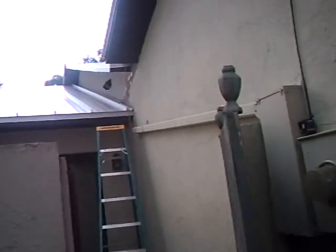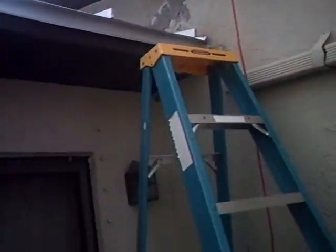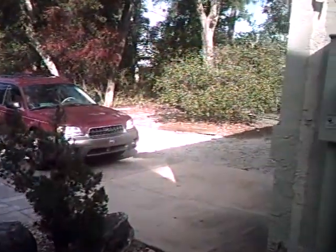So this is where the box will go. Make a capture box and then figure out some routing for the downspout. Still under construction. I'm going to paint that now to seal it up, and I like that elastomeric paint. I painted this stucco many years ago when I first got the house and just rolled it on thick. I used the primer and rolled 2 coats of primer, then 2 coats of sealer. I think they recommend you get about a 10 mil thickness on the entire coat, and I did get a heavy coat.